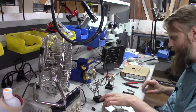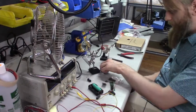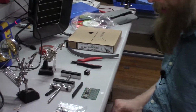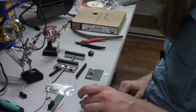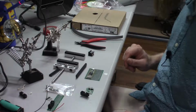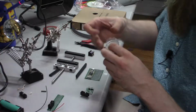It happened. Alright, so for the general layout, we're going to have Teensy on the breakout. I got these socket headers, so we're going to use socket headers to actually plug the Teensy in, because things happen and you always want to be ready for that. Then we have boards with a ribbon cable coming off of them. So these are the breakout boards for the encoders, and we're going to have a ribbon cable connector for the SPI bus and the servo pins, and a servo pin connector, which will sit on the breakout board.